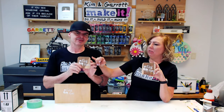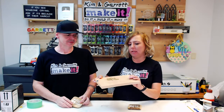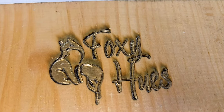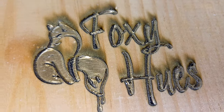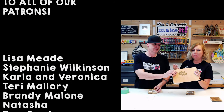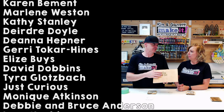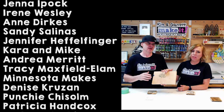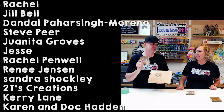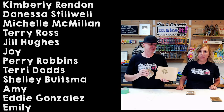With the heat gun method you do have to mask the board first. We also tried a gold powder and it seemed to leave like a gold haze. So for something like that I would need to mask anyway. Although if the engrave was deep enough you could probably sand it and it'd be OK. I don't think I would use this for anything intricate — only basic logos — nothing intricate where you might lose pieces if you had to sand.